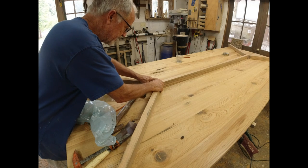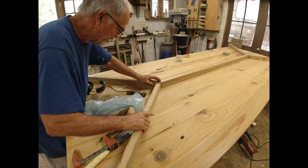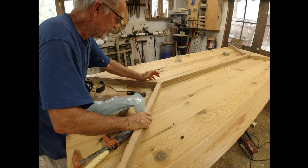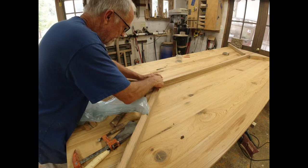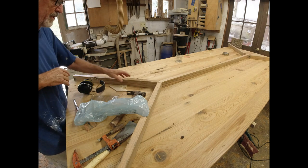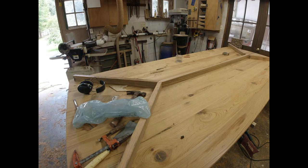I've got a joint that I like and I think it's glueable. I've got some nails in the table to keep the boards lined up on the pencil marks where they need to be. I couldn't do the geometry or the math — I just did trial and error until I got angles that I liked. This will be a butt joint so it won't be strong; I'll have to come back and either embed a plate in the top like a wishbone or make a decorative plate on the side and screw it — I think that's what I'm leaning toward. I need to cut these to length before I go too far because they're way long.